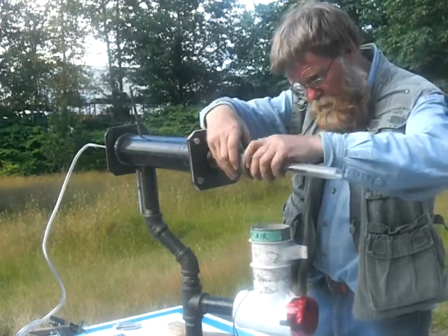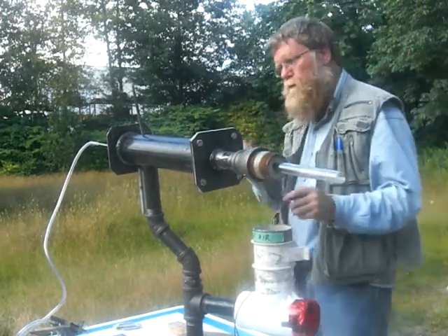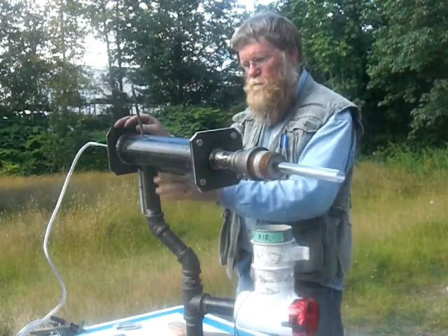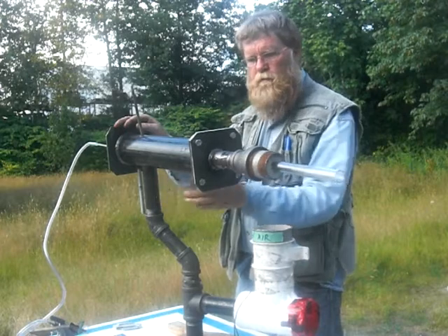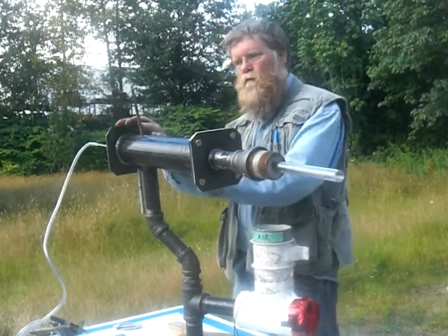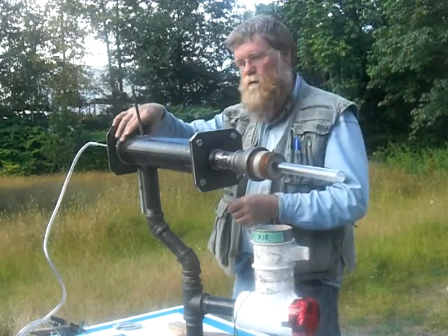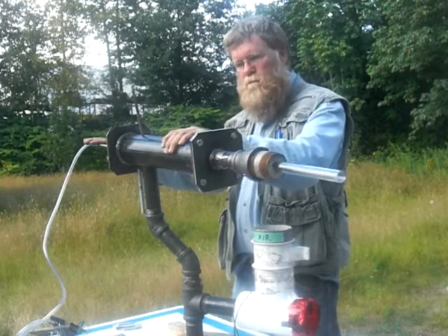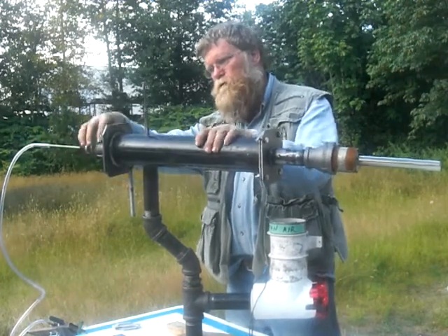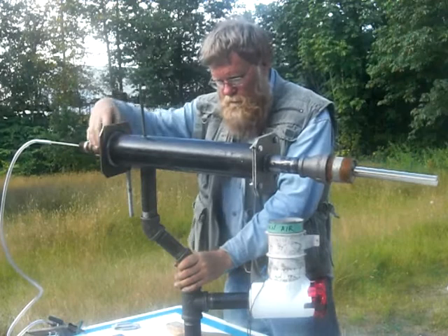I have not fired it up at this time, and as you can see I'm putting the quartz pipe on the end. The air goes up here and it's supposed to be superheated, except I had the nipple on the wrong side. Once I have the other nipple on, it will go downwind of the JoePipe and enter into a series of four holes just in front of the swirl device. The back is the same, and this is where the propane goes in — the swirl device is actually in this part here.